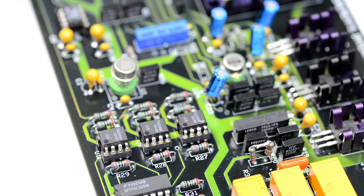So this is some custom value, 50 ppm, 1% resistors. And I think the reason why they used two of these resistors in this body instead of one of the metal foil resistors is you cannot easily get metal foil resistors in the range over 100 kilo ohm, because of the physical parameters of the foil element. You would need a bigger foil element, and that would be a bigger case as well. So instead, they just budged two of the film resistors like that.